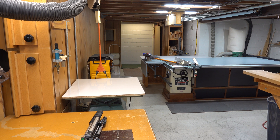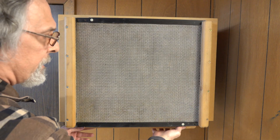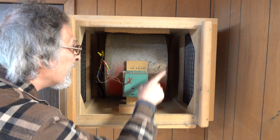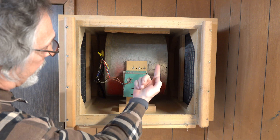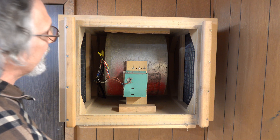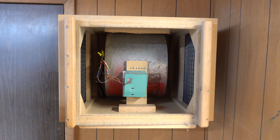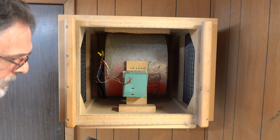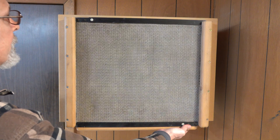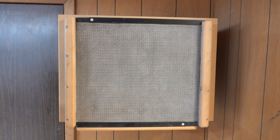Obviously, the bigger shops are the ones we're really talking about here. Something really small — maybe you won't be able to pull this off. But it works really great and I figured I would spur on some ideas. For those of you who want a better shot of this, I just spin this around — and if you have to open this up, here's how it works. So this is just a box. I put some gussets in it so that after the hole was cut, I can fasten to a header that I had put in. There are screws down in the bottom that go into another support piece that goes across the studs — kind of like framing out a window. But it's just three filters that you have to vacuum. As soon as you see that they're starting to load up a little bit, just do it. It's super fast to clean them — I'd say about two to three minutes to clean all three. You guys let me know what you think. Take care.